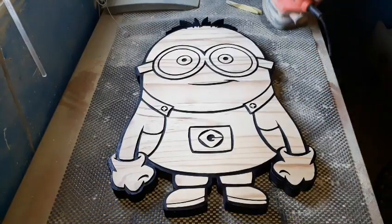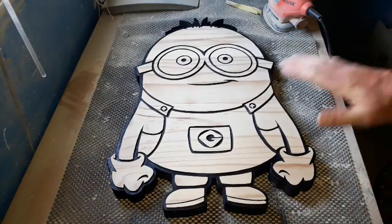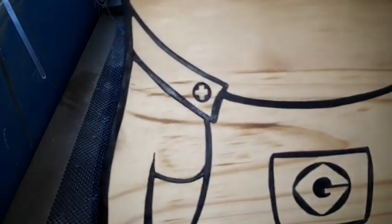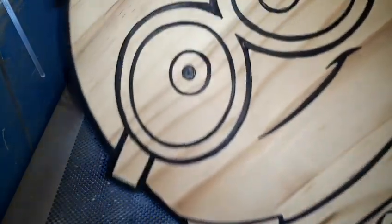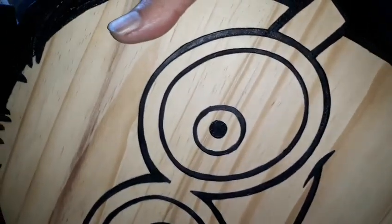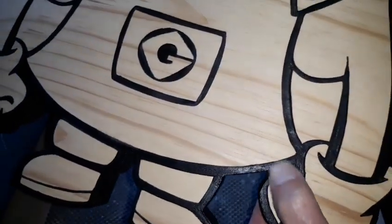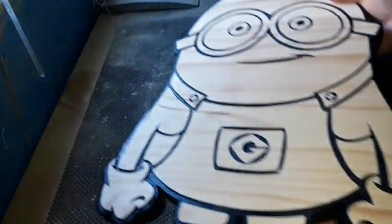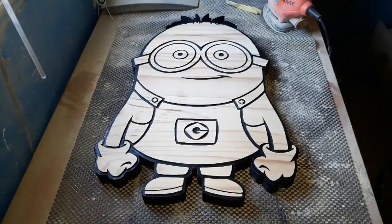If only it was that easy. I did video the sanding down but it was late at night — I used the flash on the phone and it was just like a snowstorm, you couldn't see anything. But you get the basic idea. So remember, we've put the black on and we've sanded it down — and that's come out really nice. They do go on about sanding sealers for paint bleed and stuff like that. I never bothered on this and I can't say I really see a lot of paint bleed. These little bits at the end, if you look really closely, that's not actually bleeding — it's just that we've not sanded it off properly. But there's a dark brown on there so what's the point of going over the top? No sanding sealer on that one. So far, so good. Okay, we'll put on the rest of the colours and then come back when we're going to put our final clear spray on.